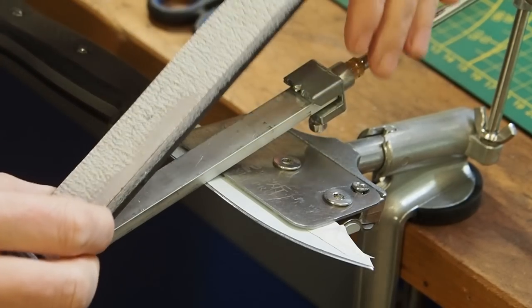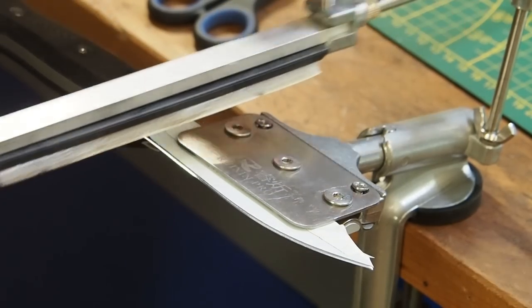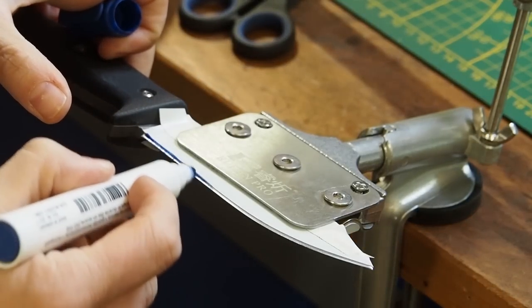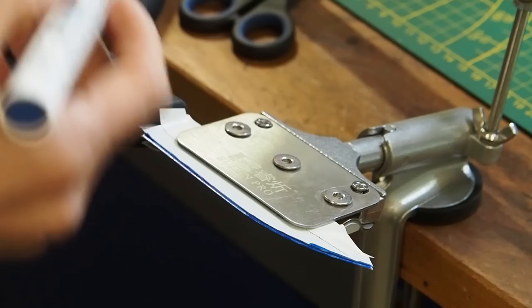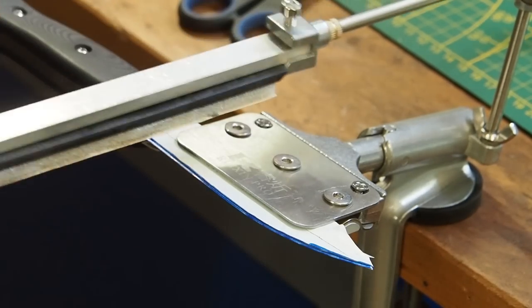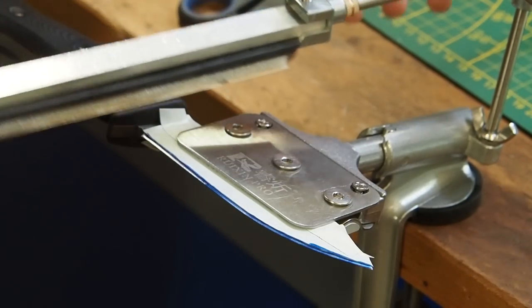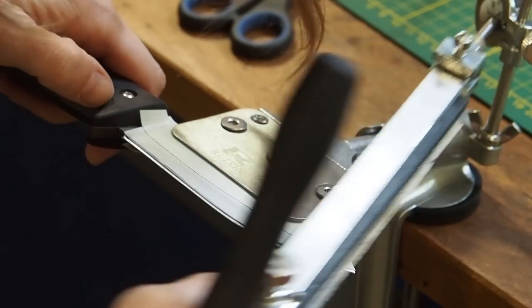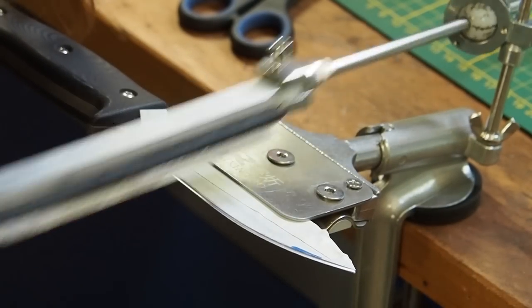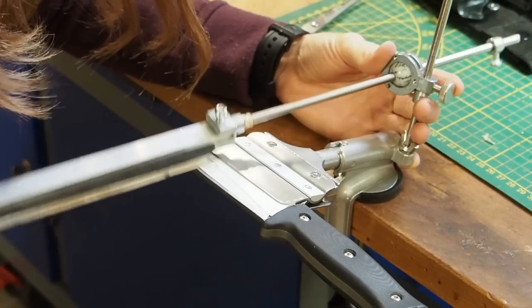Okay, and now I want to insert the first stone, which is 240 grit sandpaper, and next I take a marker and I mark the very edge of the knife, and this way I can see if the angle of the sharpening stone is right or not. Okay, so here I can see it's a little bit too steep, so I have to go down with my sharpening jig. So now we have the perfect angle for this knife here,